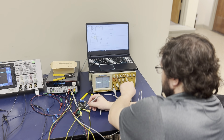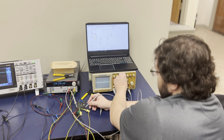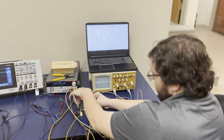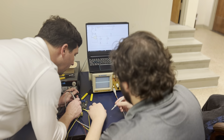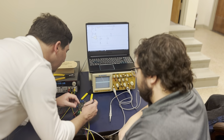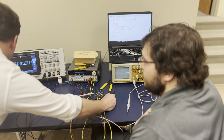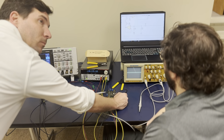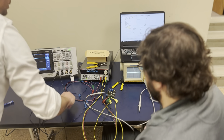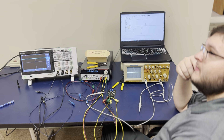You can do it with this scope too, if you wanted to. Let's see if a different switching type gives us a cleaner result. It doesn't help much. If we look at it — you kind of need to see that return signal somehow, and capture it. That one's not referenced. It's definitely not centered around zero to one. So that's your problem — it's shifting. Well, it's throwing a negative voltage. You need it to be minus one plus one. This is the time where I can walk away and when I come back, maybe it's plus or minus one.